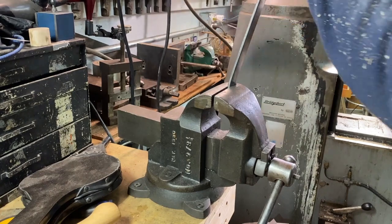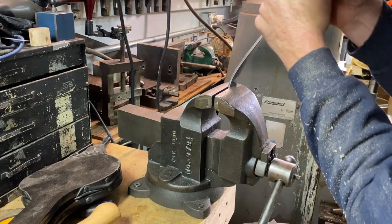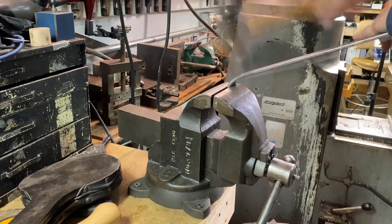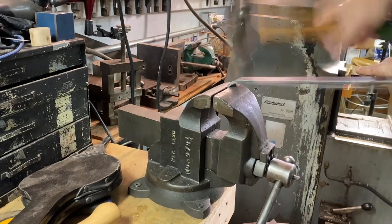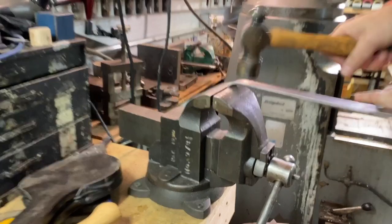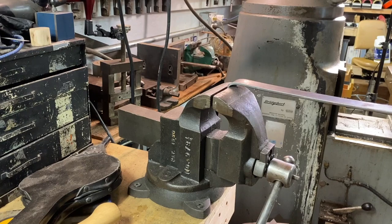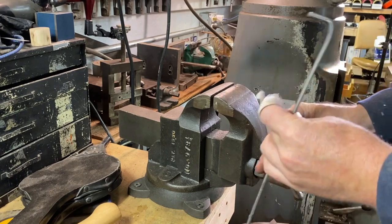Right here I'm making a little bracket. This is super simple — some one-inch flat bar, three-sixteenth inch thick, and I'm just bending a little right angle on it. This is going to attach to the bottom of the ladder and also attach to the baseboard in the bathroom.